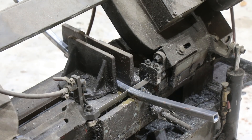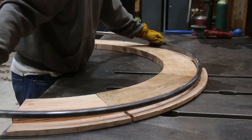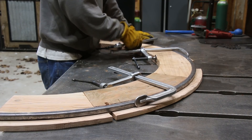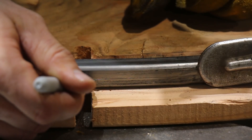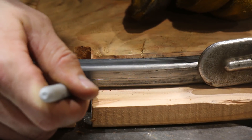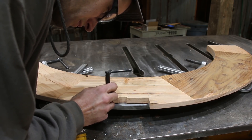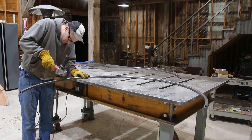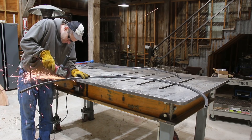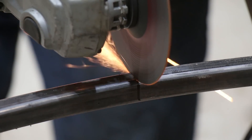I used the bandsaw to cut off the ends of the tubing that weren't rolled — this type of roller always has a little bit of waste. I incorporated cut lines into the design of the jig that I could use to mark the ends of the rolled tubing. I also marked the location of the connecting plate in the middle that all four pieces of the cross bracing would bolt to. The reason it was designed to be bolted together was just to keep the cost down of shipping the parts all the way to France, where Martin and the Marble Machine lived.